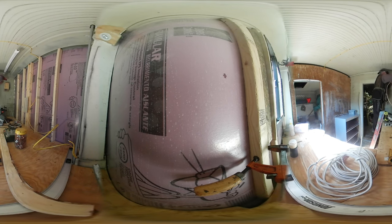There we go, Governor. I'm going to take it right there. And then we're going to end up cutting that. I'm going to give myself a little drip loop here to cut it on. I gave myself 8 on each end, so that means I've got room for a 16 inch loop.